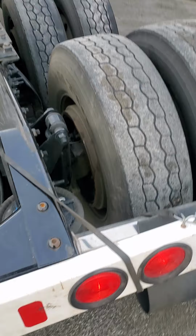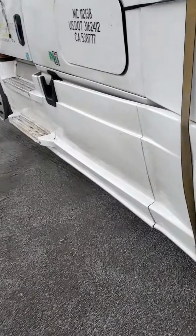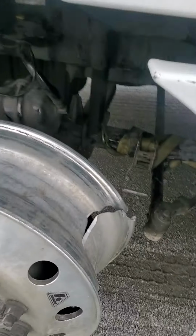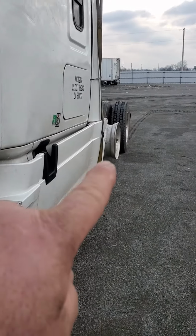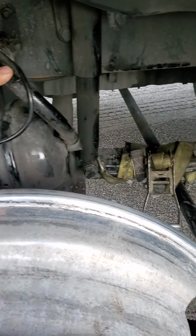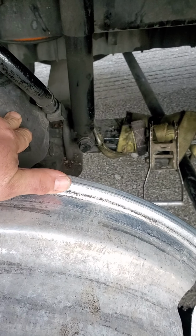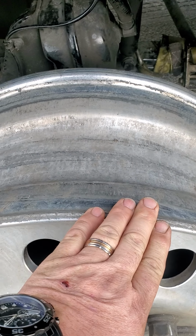Also, whenever you tow a truck, you're supposed to, DOT regs, a lot of guys don't, I mean, people just free up the brakes, but this is your front brake chamber. And obviously, if I were to pick up the truck from the rear and then your two front steers were on the ground, there on the Pro Tote, you take your regular line out and then you hook right into your brake chamber with your air line, and that gives your towed tractor brakes.